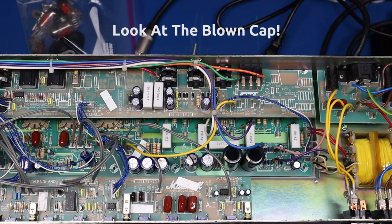A couple of quick observations - as I've stated before on other videos, 70-80% of the time, roughly, there is a visual indication of the problem. Take a look at this guy right here. The top has been blown off of this electrolytic, and I've cleaned it up a little bit - there was some electrolyte material around it. So that's an obvious indicator.